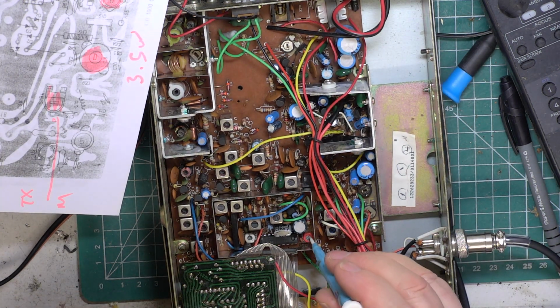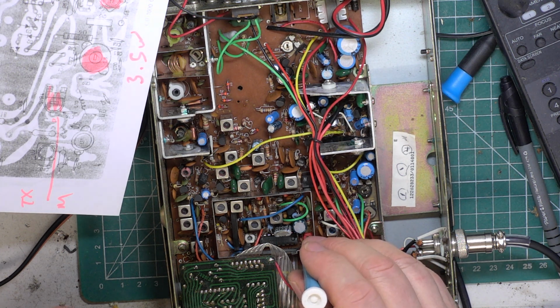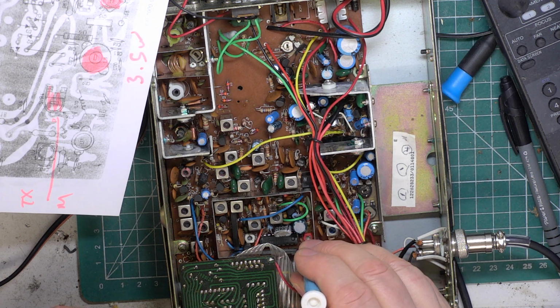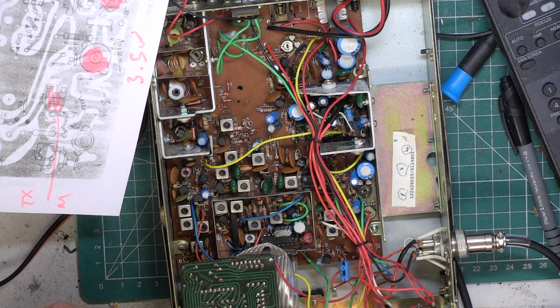So it's a trimmer capacitor here, it's TC202 or CT201 even. Hope it'll go. So do it slightly high, so it's 27.7912, 6 toggling 7. Put the screening can back on later, and now we'll run through the transmitter.